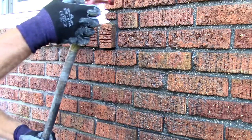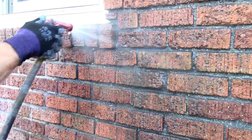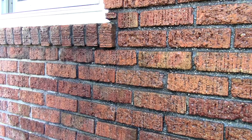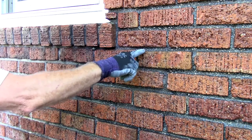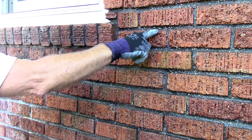Our next phase is a very gentle hose. Now after we let this dry, we'll come back and demonstrate the cleaning process. But you can already see the brand new mortar broadcasting the aggregate that replicates the original 100-year-old type K mortar.